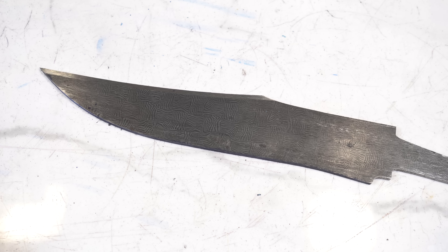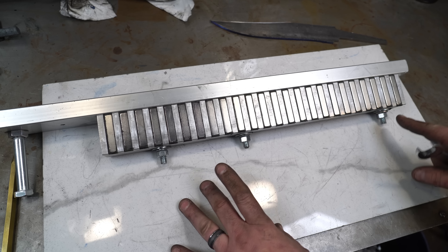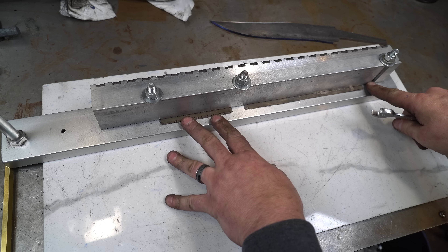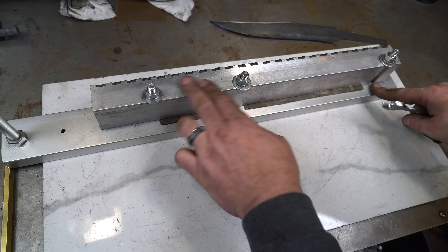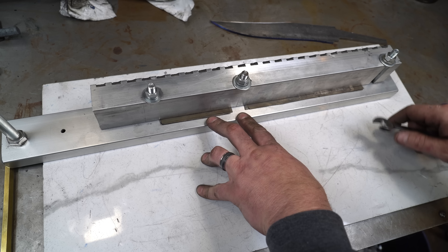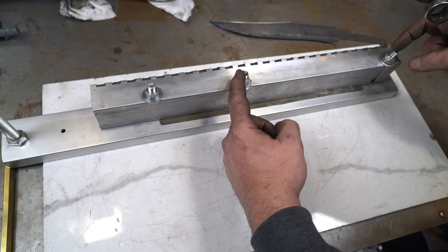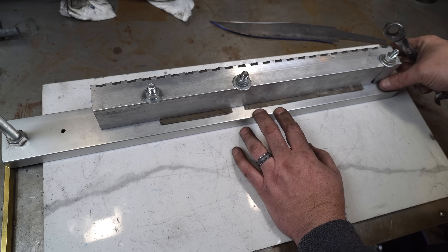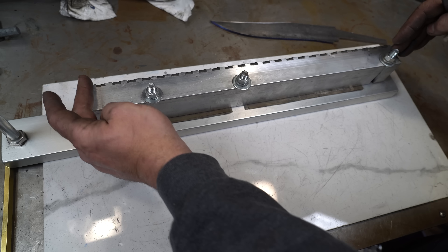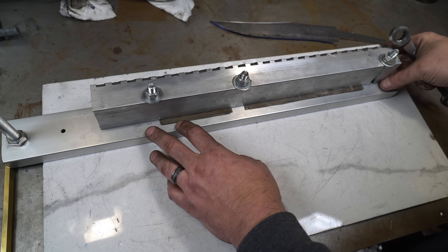So here's the mag chuck, and I'm going to explain how we get a distal taper. I'll flip this over on the side — you can see that one of these has a channel in it. Most surface grinding attachments you buy should have a distal taper attachment. All I need to do is remove this bolt, loosen this one, and then I can raise this chuck just a little bit at one end. That makes it higher at one end, so when we put the blade in at the same point on both sides as we flip it, we get our distal taper.